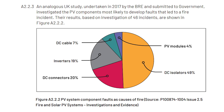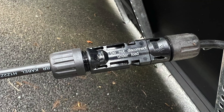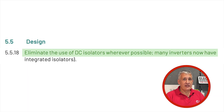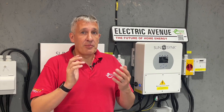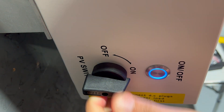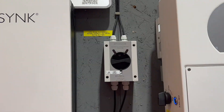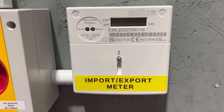DC isolators and connectors are widely acknowledged as the components with the highest risk of developing faults, ultimately resulting in fires. RC62 has some very clear guidance and recommendations for MC4 connectors, which we will explore in a future video. However, with regards to isolators, under section 5.5 design we can read 5.5.18: eliminate the use of DC isolators whenever possible. Many inverters now have integrated isolators. So for me this is very clear — the best practice is to rely upon the DC isolator built into the inverter, if it meets the associated product standard, and not to install external isolators. Let me know what you think by sharing your opinion in the comments.